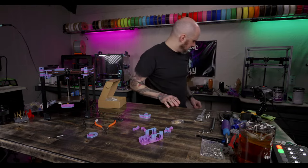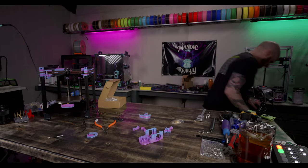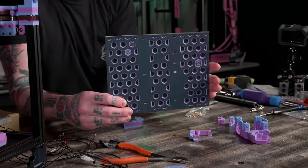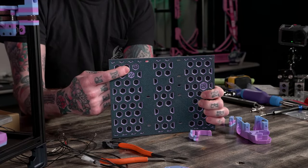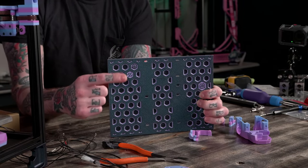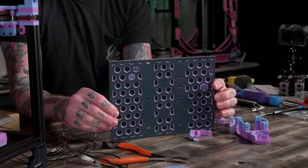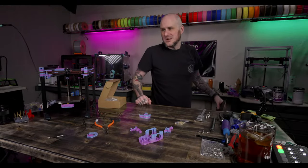The second issue is, where did I put my hex panel? The one I'm gonna use anyway. Well, here's one of them. Connor, Zachary, welcome. The Zero Filter mounts right here inside the chamber, and then my chamber thermistor port is right there. I know it draws air in from the top and blows it down, but I feel like it's gonna create air circulation right next to the chamber thermistor and maybe throw off the readings. And the Zero Filter would also block this cool looking design that I made. So I'm just not sold on it for any of my projects. Looks like a great setup for a lot of applications, not for mine.